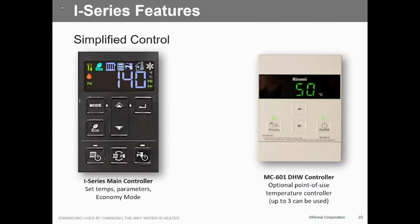And it reports back to us. Are those now wireless? No, they're still wired. Still wired. It's low voltage. It is 12 volts DC, so it's just standard 18 gauge. 350 feet total.